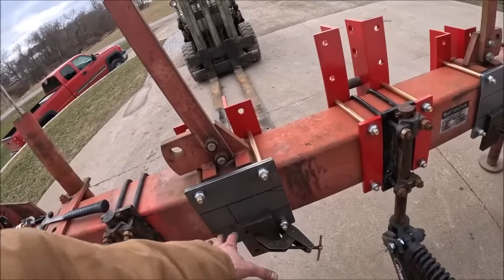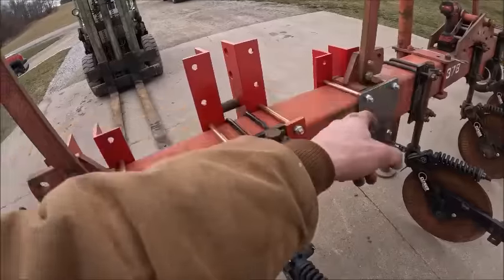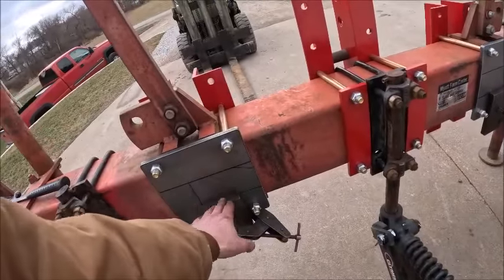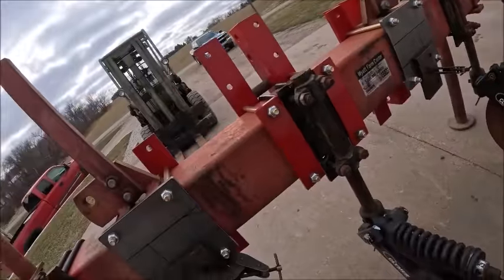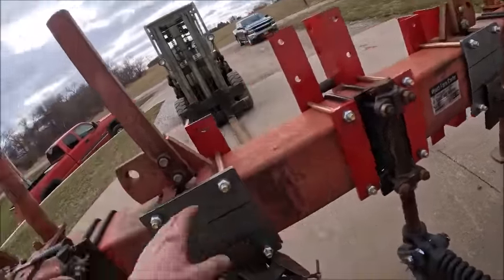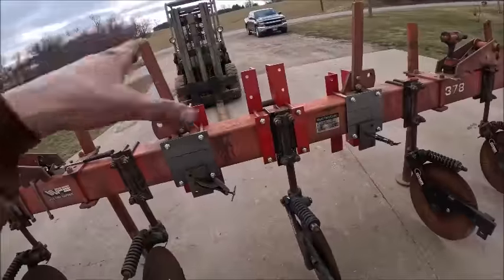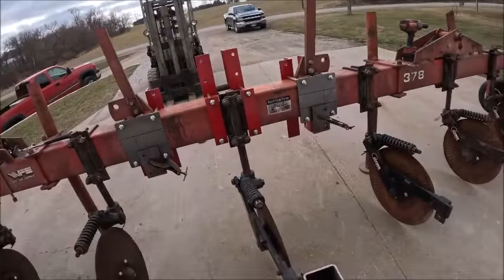And then once I had them on there and clamped, I took a square, went off the top edge of both, and made sure that the cleats were, they're going to end up being 6 1/4 to the bottom of the tube. So my lines were off a little bit when I drew them on, but that was fine. I just needed them there to get the cleat started. So now the cleats are both the same height from the top of the plates, and they're square to this edge. So everything's square.